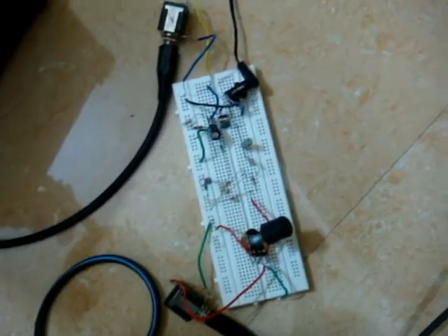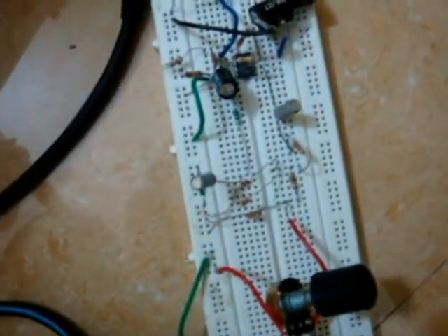This is the circuit I just built. It's called the Blue Clipper Distortion Pedal, and it produces distortion by utilizing the TL071 op-amp. It's connected in an inverting configuration.